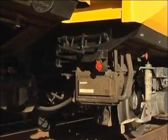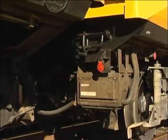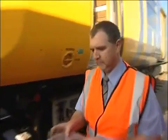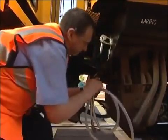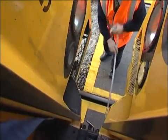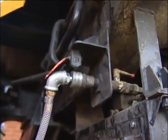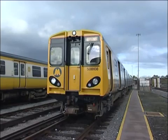If you require to couple to a failed unit for assistance purposes, it'll be necessary to maintain both drum switches in the uncoupled position. When coupled in this condition, the main reservoir air connections on each coupler will be closed, so you'll need to obtain the emergency air hose from the offside cupboard. Plug one end into the Schrader valve on your unit, pass the hose over the couplers, and plug the other end into the Schrader valve on the failed unit. Don't forget to open each of the main reservoir air cocks behind the Schrader valves. Don't press the couple button when you return to the cab. In this condition your train may only run at a maximum of 5 miles per hour to clear the main line.